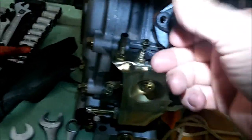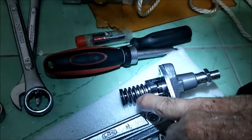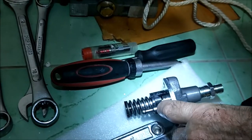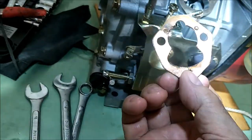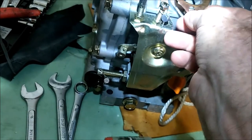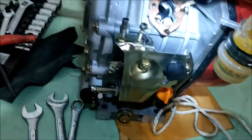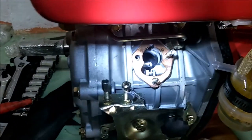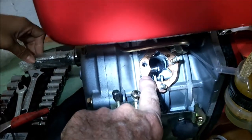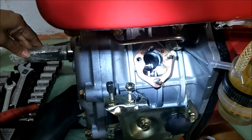Then you can watch it through that side hole to make sure you've got everything lined up — the metering arm going through the fork. Also, these shims here are very important: they adjust the timing of the fuel pump. Thicker shims start the pump pumping later; thinner shims start it pumping sooner. If you're at higher altitudes, around 5,000 feet, you want a thinner shim. If you're at sea level, the one that ships with the unit is probably appropriate.